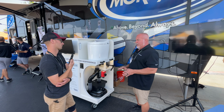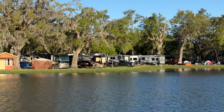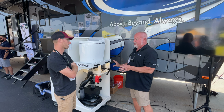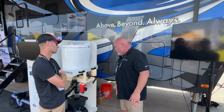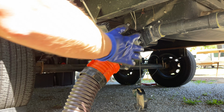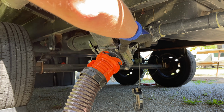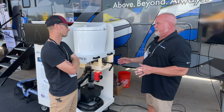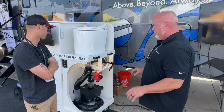But even though I don't use my black tank when we're sitting stationary, if I am going to sit for a long period of time, and we will add this, this is good that this question came up, we'll add this to our instruction manual. It still will be recommended that you close that valve, fill it, and flush it at least every quarter, every 3 months. Yeah. And this way you are exercising the valve and the cable and making sure that the tank has no buildup. Even though you're not using it, let's face it, there's still some residual. Once they're used, you're never going to get it out. Yeah, it's never perfectly clean.